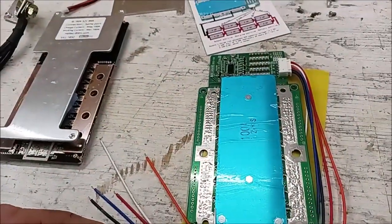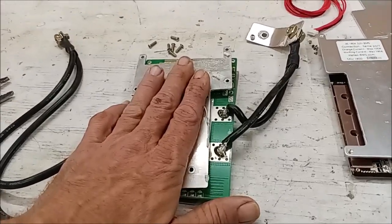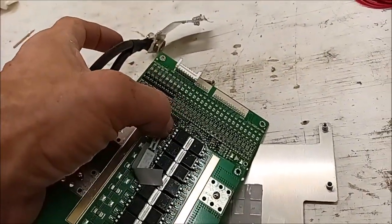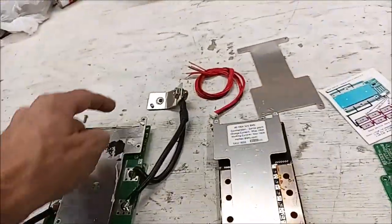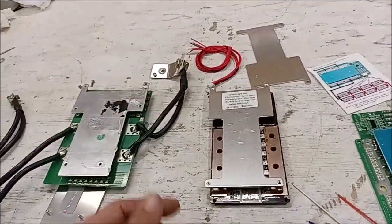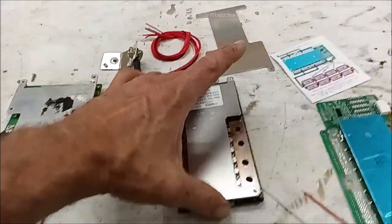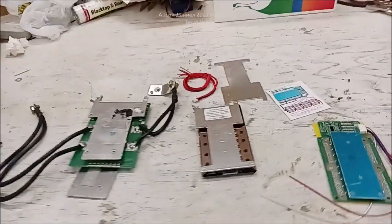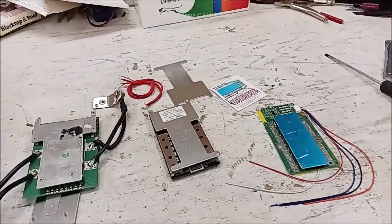The Helltech 180-amp wouldn't even want to get close to that load. This JDB here is actually a 120-amp, and we did figure out what failed in it - the processor chip failed. It has no power on pin 6. I can't order a replacement because there's no number on the chip, but we know pin 6 is the power line because it runs back to the positive lead through two diodes. The JDB is probably a good one overall. Helltech is total garbage. I'm going to demand my money back - do not buy Helltech products.